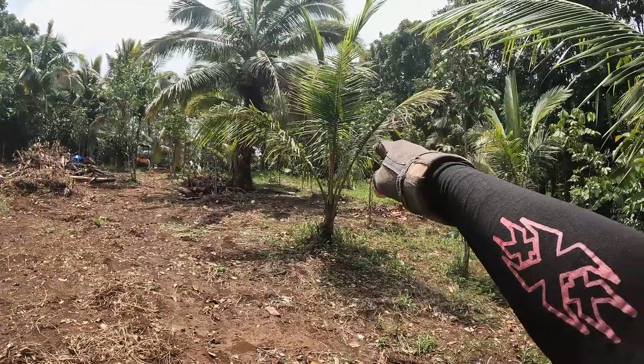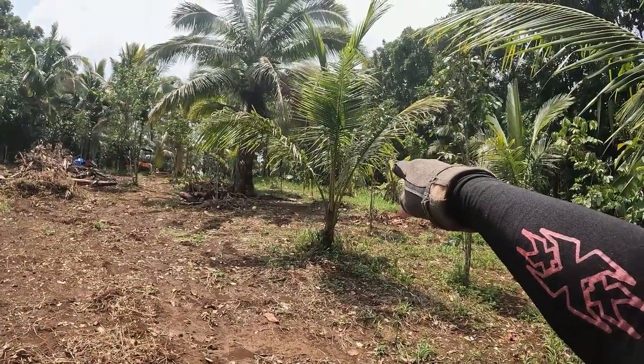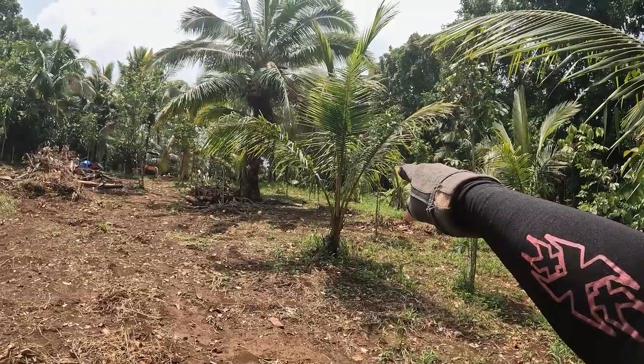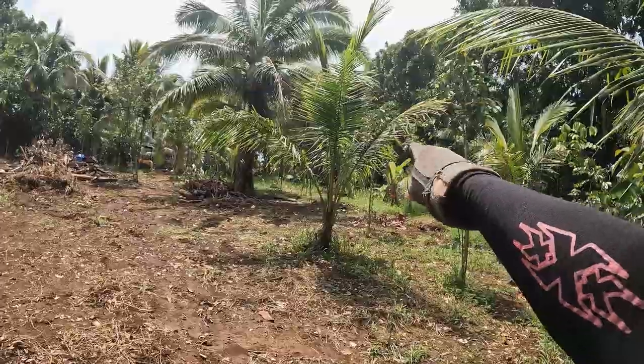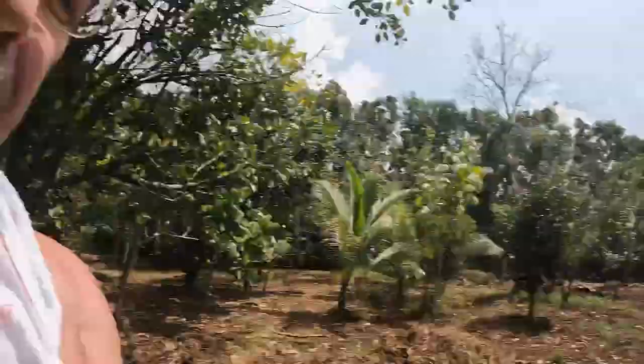That said, the septic tank is going to be up here. I don't want to run septic pipes this far down. Septic tank will be up here. And we do plan to separate black water from gray water for a couple reasons. First, not to overload the septic system, and secondly, that gray water is going to come right back into use for irrigation as well.